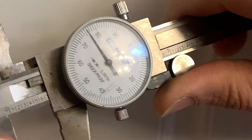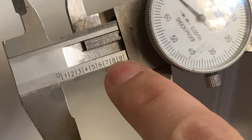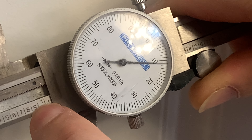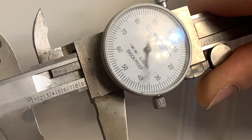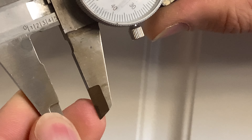If you were to go ten revolutions, you have these numbers here. We're going to reveal right there — you can see the one, that's one inch. So if it just barely reveals that one right there, that's exactly one inch. Or if it barely reveals the five, that of course would be a half inch.